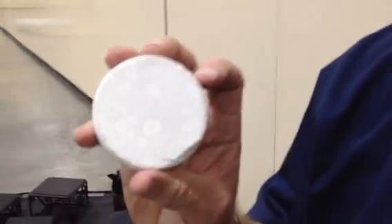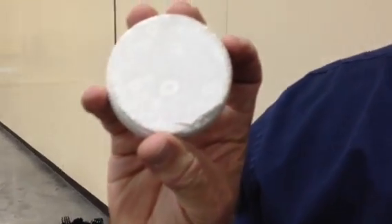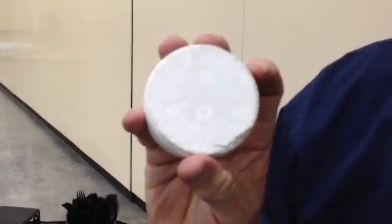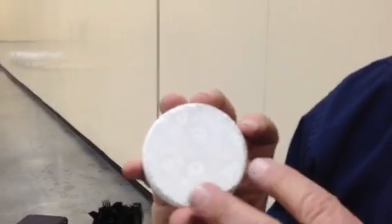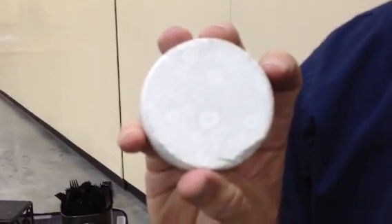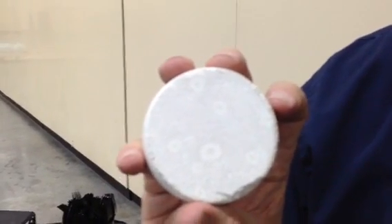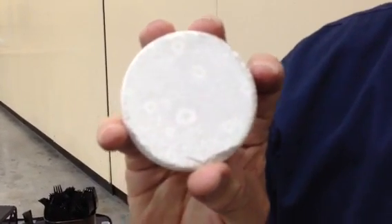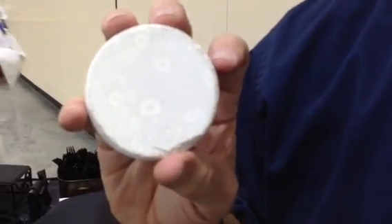So those white spots appearing — the porosity — is it now less dense and maybe a softer area? Eventually would there be more problems in those lighter spots? The porosity creates a weakness. It allows water to penetrate, so it is no longer dense or compact and therefore allows water — even whether it's balanced or aggressive — to interact with the cement compounds and dissolve it. These areas are deteriorating, and in time they will actually just be pitted because water, the universal solvent, is going to dissolve these areas and they're going to be even more pronounced and rough as time passes. Therefore, the surface will not last as long as it normally would — usually 20 years — and this surface is going to decay and probably need re-plastering in less than 10 years.